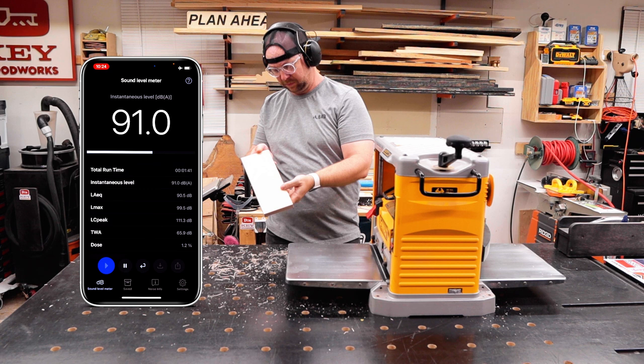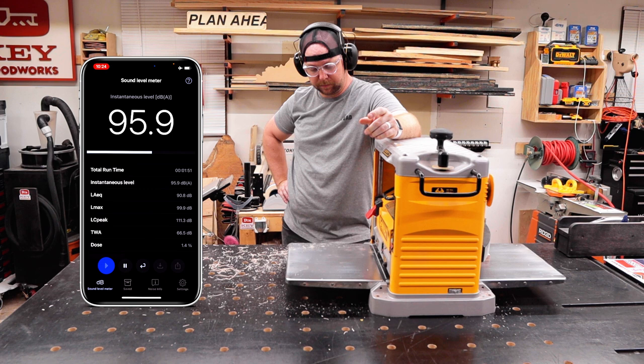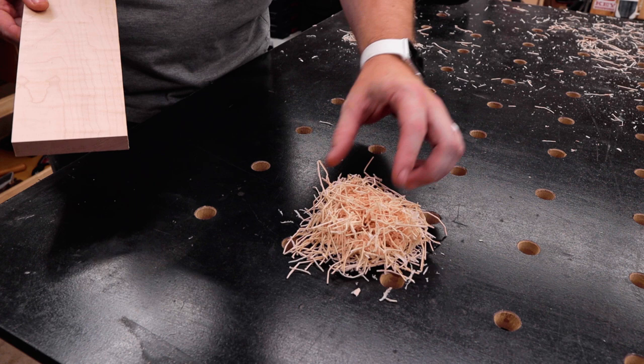You will for sure lose some hearing if not. After three passes, you can see that on average right around 100 dB is the loudest it gets when making a cut — that is the equivalent of using a jackhammer. So basically using a three-knife planer to mill some lumber is the same thing as using a jackhammer to break up concrete. That is loud.